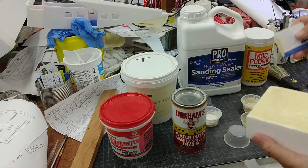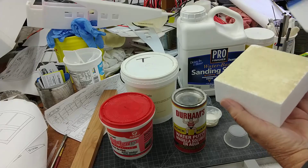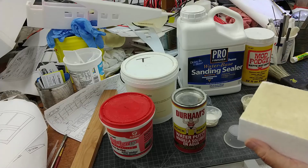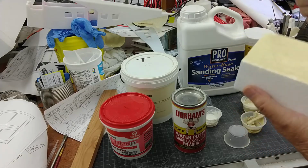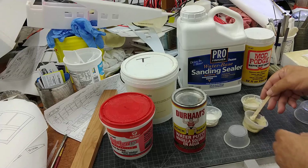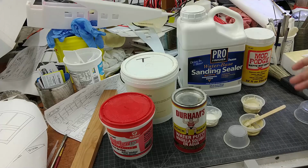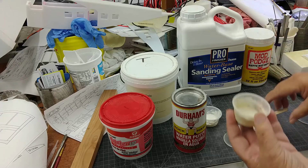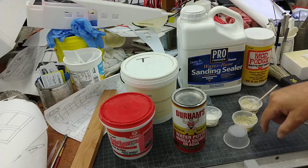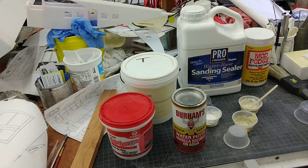If you make it too thin, what happens is that, like liquid, it follows the curvature, it follows the divots, and it will put a little bit of that filler in there, but then you've got to put on another coat to finish filling them up, or another coat, or another coat. This way, if you've got it the right consistency, you can go over it one time with this paste and it will fill, and then you sand it off. So don't do this. That's too thin, that's too thin. So get it the right consistency. Now let's see, where was I? I had to do that because we're standing here in an air conditioning stream and the air is making this stuff thicken up on me. So back to this.